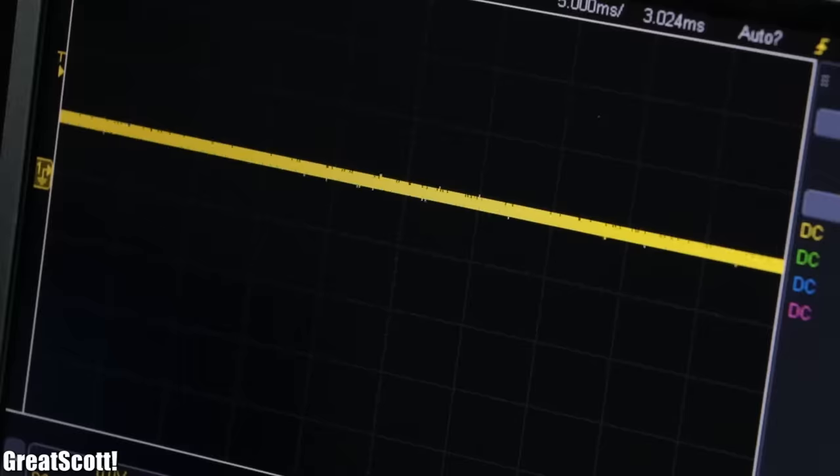To my surprise there was no explosion — instead the LED on the module simply lit up. Looking at the outputs we can see the filtered pure sine wave with an RMS voltage of around 8.5V. That means we also need a transformer, which I hooked up the same way as I did with my modified square wave inverter. After adding a small load, everything seems to work, but the voltage waveform shape is not that pleasant to look at. The output keeps shutting down after a certain time while the module LED flashes 4 times, which according to the datasheet indicates an under-voltage problem — since there is no feedback from the high voltage side of the transformer yet.